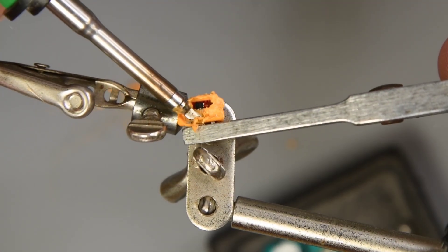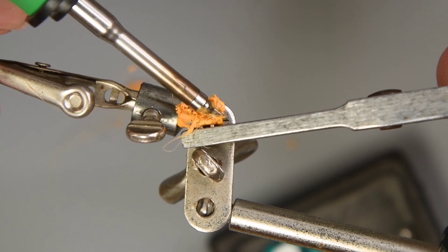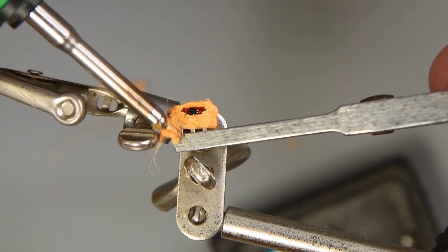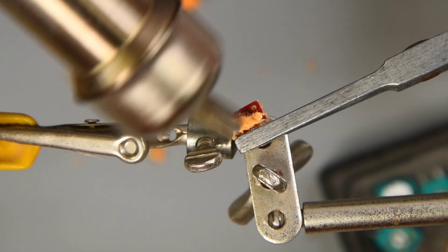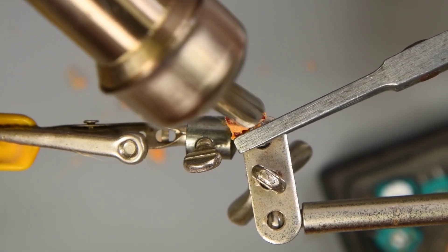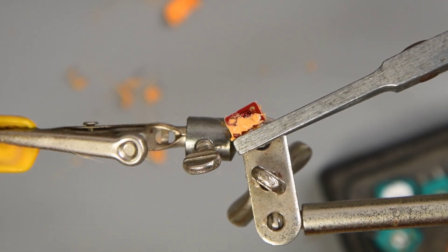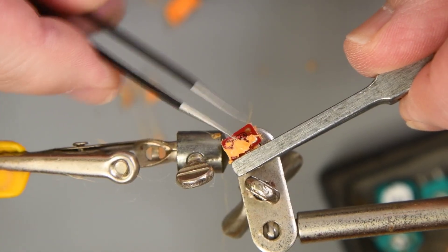I'll have to remove the plastic housings without damaging the parts or PC boards. I have my plastic tip on the soldering iron and the temperature set to 490 degrees Fahrenheit. I have the hot air station set to 525 degrees Fahrenheit with 30% air volume. It's going to be a slow process — I'll cut away some of the plastic with the iron tip, heat it up a bit with the hot air to soften it, and try to peel it off the board.